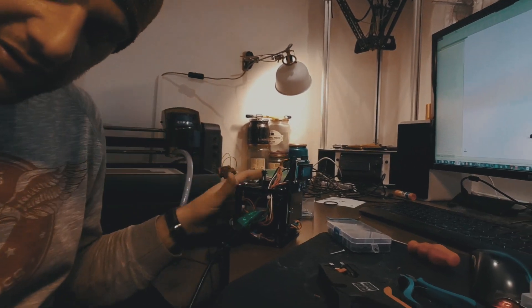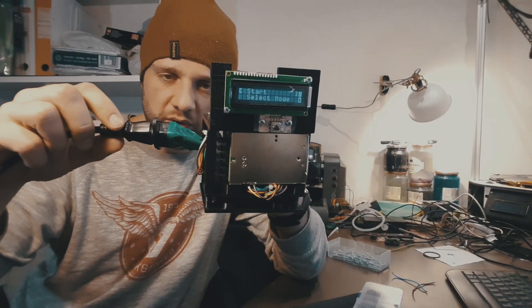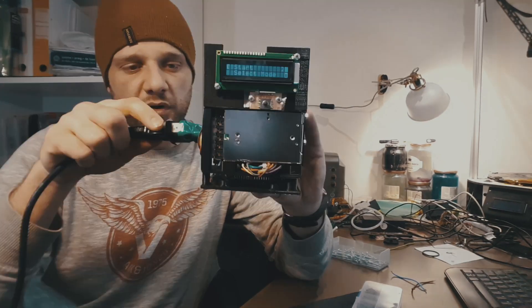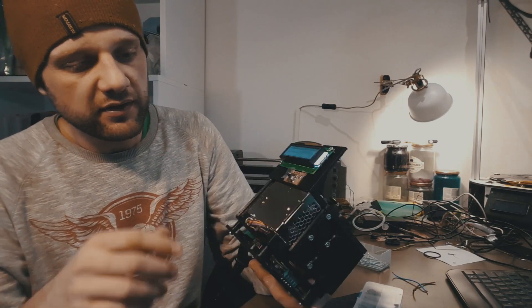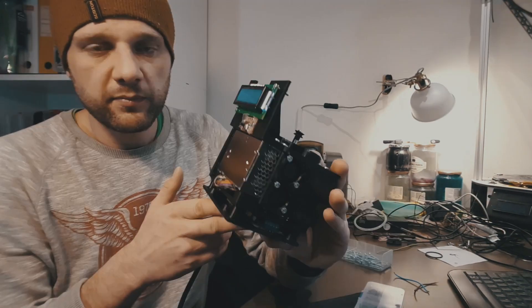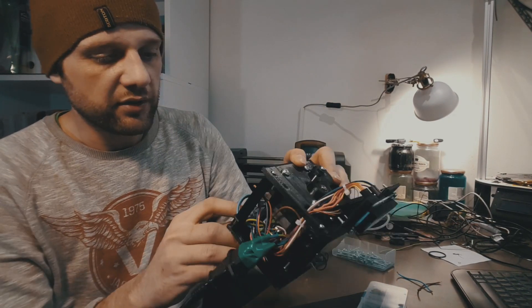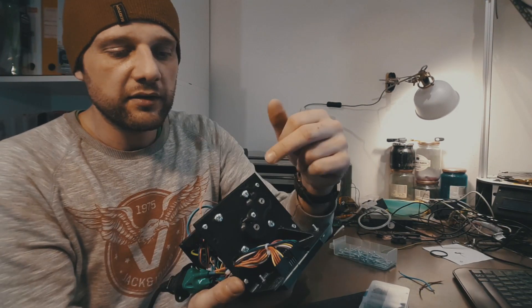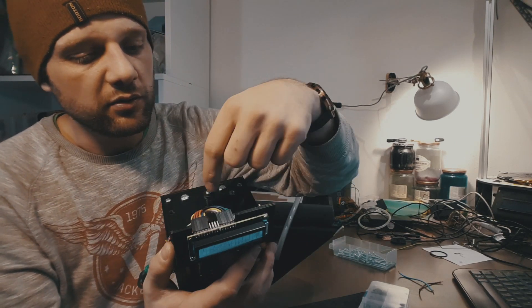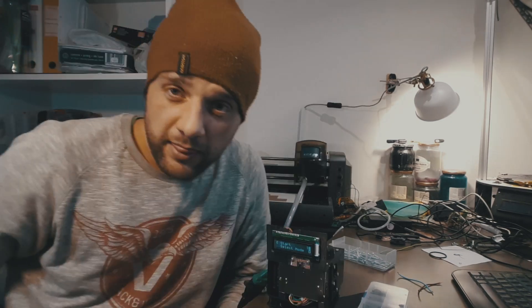It's a contained unit. Electronics are now integrated in here — we have a unit with the power supply, the motor, the Arduino up here, the shield down here, a power current measure here, the LCD, and a little joystick. And here the gearbox will be attached, so basically the shaft here, gearbox, gearbox, moving camera. That's the next part — building the rest of it.